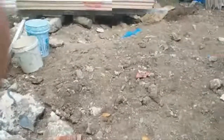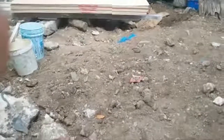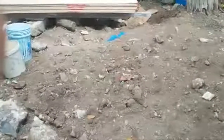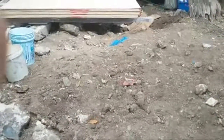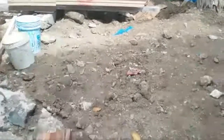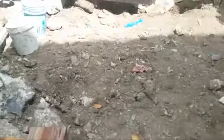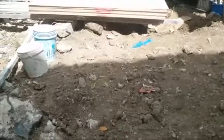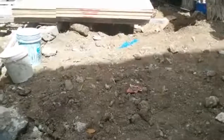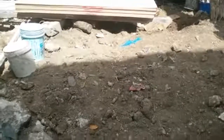Then right over here, centered at the end of the plywood, is going to be another concrete substrate. I'm going to dig down to the coral, which is about 1 foot, and build it up with some big stones and put another layer under here about 9 feet from the back substrate. And then I'm going to have septic, and then there's going to be a 2x12 on top, a 2x9 on top of that, and then the container is going to be set on top of those.